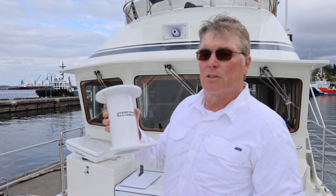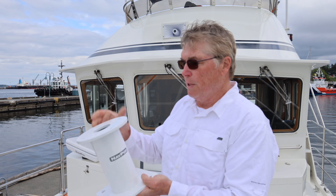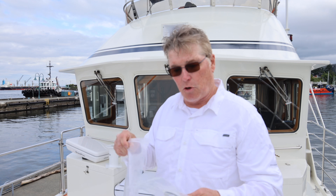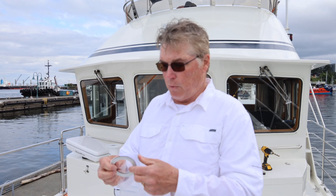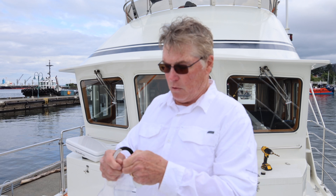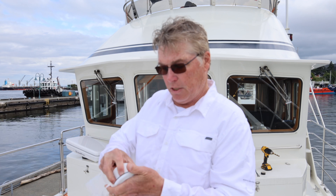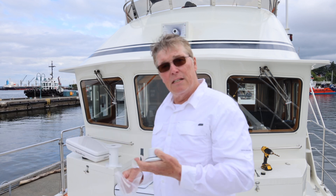Over here is the new Star Tower — it's part of the system. The Star Tower is 8mm powder-coated aluminum, very sturdy, very strong. Inside the parts kit that comes with the Starpod system will be a couple of gaskets — a Teflon one as well as a unique one with a PSA adhesive on both sides of it. You put this onto the top of the thru-hole as part of assembly, then peel off the rest of it, and stick it up inside the Star Tower.